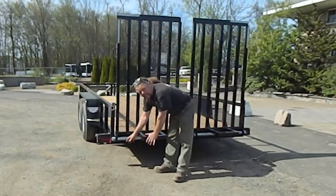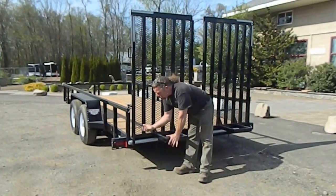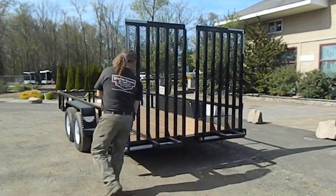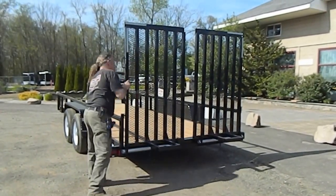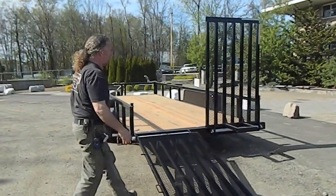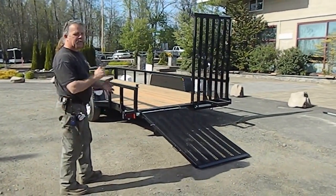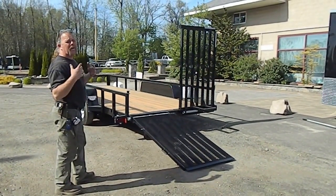Five foot with a leg support. These guys use a galvanized pipe, which is nice because you're going to move the ramp left and right — it still moves and you never knock the paint off. Put the spring assist on it. You got a nice load angle for your smaller skid steers, smaller mini excavators, smaller tractors, and the trailer's certainly light enough to haul around mowers.